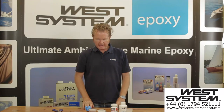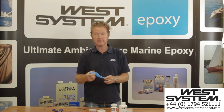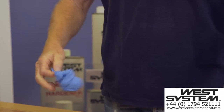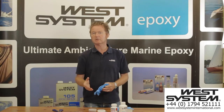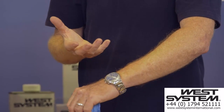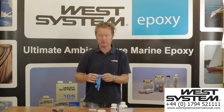And the first thing that we would want to do is prepare ourselves for working with West System epoxy. And that involves wearing some durable gloves. Very important to avoid skin contact. If you do get skin contact with the resin and hardener mix, it's very important that you don't clean it off with solvent. If you use solvent, it will force the resin and hardener back into your skin. If you get epoxy on your skin, wash it off with copious amounts of soapy water or our West System hand cleaning solution.